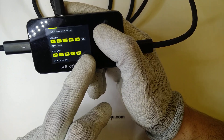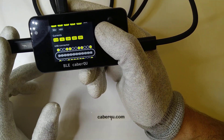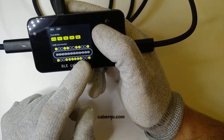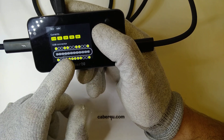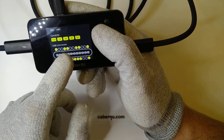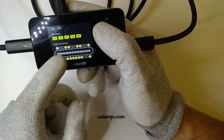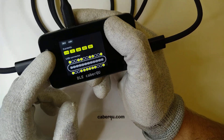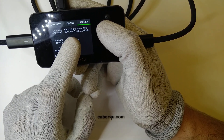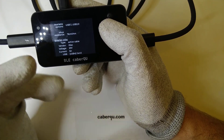Similar to the first cable, it can do 20 volts at 5 amps, making it a 100-watt Thunderbolt cable — not 240 watts. The USB connector pinout is the same as the previous two, but now with sideband unit 1 and 2 also connected. So it has: Ground and VBUS, D-plus and D-minus for USB 2, CC1 and CC2 for power delivery communications, and sideband unit 1 and 2 connectors — but not the RX1, RX2, TX1, TX2 pins responsible for USB 3.0, 3.1, and 4. The VBUS resistance is at 76 milliohms, which is acceptable, and there is a shorter pin inside as noted.